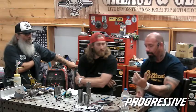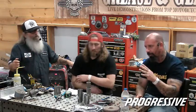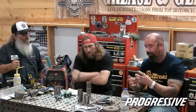Yeah, stainless is more sensitive to movement for sure, more problematic. Like in welding a frame, kind of what I said before, how you have to adjust your amperage at the tail end of a weld because you've created that heat. Well, that same principle applies to that metal moving, and the heat's what makes that happen. So, for example, the top tube's 1.25 inches round. Once I tack, which is usually in quadrants or even more, then I'll connect parts of those across from each other. It's kind of when you lock down the wheel on your trailer or your truck, you kind of cross around. It's the same principle, and you're distributing that heat, which seemingly may not sound like a big deal, especially on such a small circumference, but it really does make all the difference.